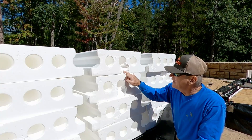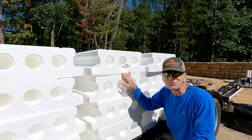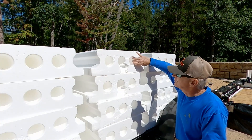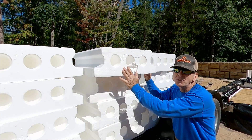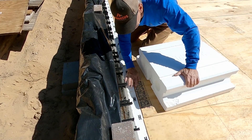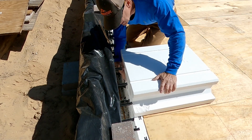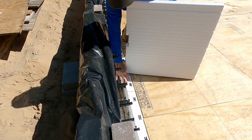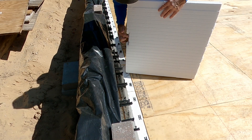As you can see I have a few of the styrofoam forms that are damaged. The truck drivers don't know that when they put their straps on and ratchet it down, it just bites into the ICF form. The ones that are damaged I'm going to put in a specific spot where this will be hidden and covered with concrete — no harm no foul. The build deck form is going to overlap on top of the ICF wall, so that bad damage spot overlaps and rides right on that wall. Nobody will see the damage spot because wherever the wood is, the wood will be removed, and if it's less than two and a half inches, nobody sees it.